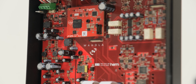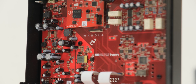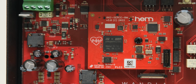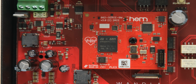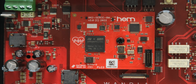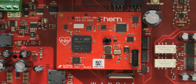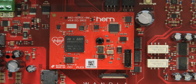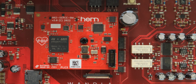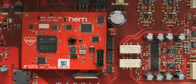Going further, you can see a small daughter board hovering atop the main board, which is called Serce, which is probably the most important part of the unit. Serce offers a set of audio-optimized digital inputs that work together with a custom programmed ARM processor. It performs the tasks of 5 individual chips, shortening the signal path considerably. 2 femtosecond clocks can be found on the same board, a Burr-Brown SPDIF chip, and the big one is the ARM CPU, which I previously mentioned.